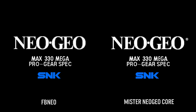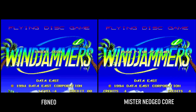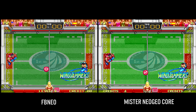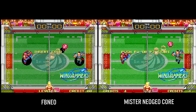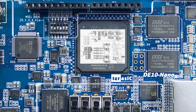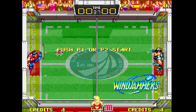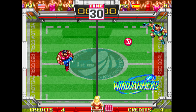So how exactly does the MiSTer work, and what makes it so different from traditional software emulation? The MiSTer runs a separate hardware emulation core for each system, and these cores are a recreation of the original hardware schematic stored in the Altera chip, done using HDL — a hardware description language. Reconstructing an entire schematic of an arcade PCB can range from difficult to extremely challenging. In many instances, reverse engineering and decapping of hardware chips is necessary, and this process can take thousands upon thousands of hours.